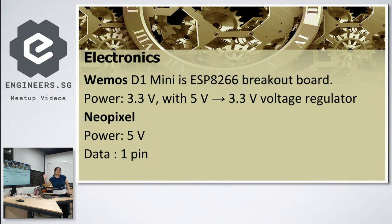Quick introduction to NeoPixels: a NeoPixel is a programmable LED bulb. You can send data to it and ask it to change colors — it's RGB. The beauty of NeoPixels is that you can link, say, eight of them together and control all eight with different colors using just one data pin. You don't need eight different pins for all of them.